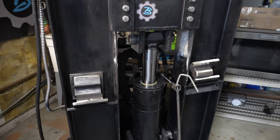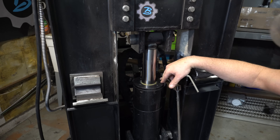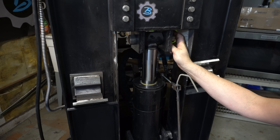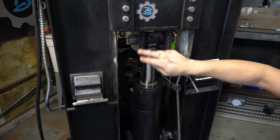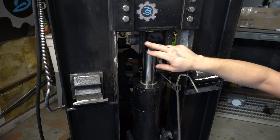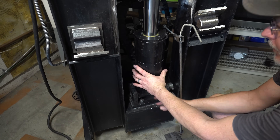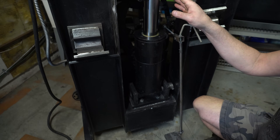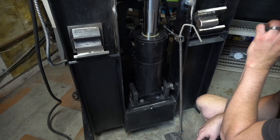This is a thirty-ton cylinder — five inches in diameter — and it's the kind that has a cylinder clevis at both ends, so there's a pin on both ends. This is a one and a half inch pin. I didn't have one inch plate so I used two half inch plates welded together, drilled with a hole saw, and welded them to the head. I made the bottom carriage removable so I could get the cylinder out.